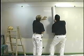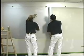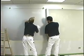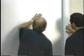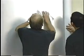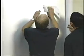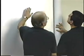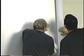Once the first installer lines up the wall talkers material, use a plastic smoother wrapped with a soft cloth, and with downward and outward motions, remove air and excess paste pockets from under the wall covering. Since these tools vary in texture, we recommend wrapping the smoother with a dry, soft, clean cloth to protect wall talkers from damage. The second installer should continue to unroll the wall covering slowly and evenly as the first installer works closer.